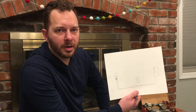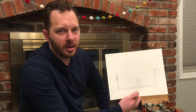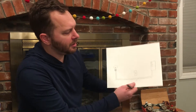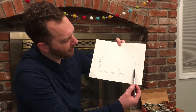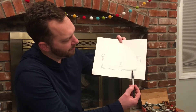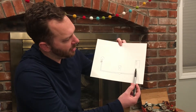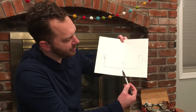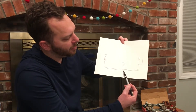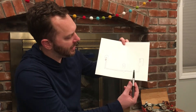The first thing we're going to go over is what it should look like if you have a neutral wire in your box where your switch is located. I've drawn up a simple diagram here. You've got your breaker box. The neutral wire comes down and goes all the way across to the light. Then your hot line, or black wire, goes down, and that's what the switch is connected to. You're manually pushing up and down on this switch to turn the light on, where the resistance is added.